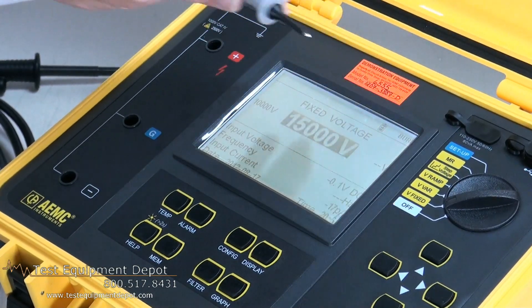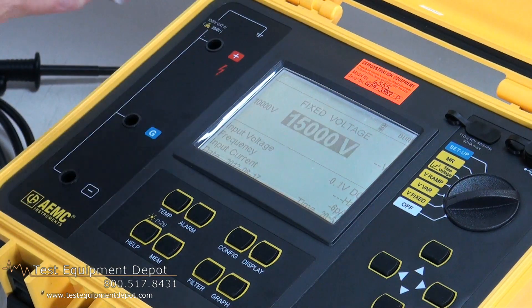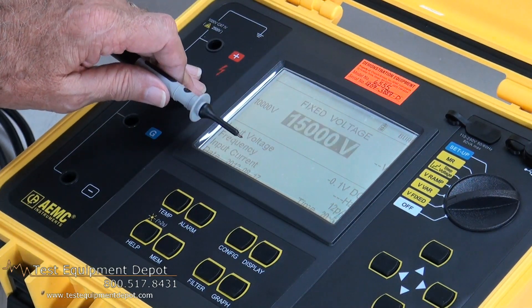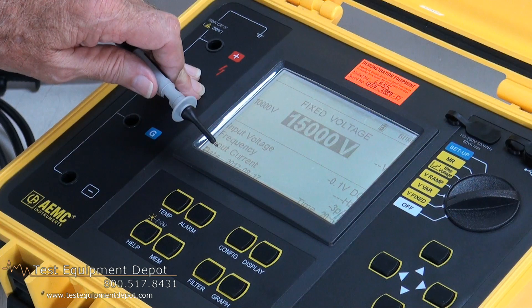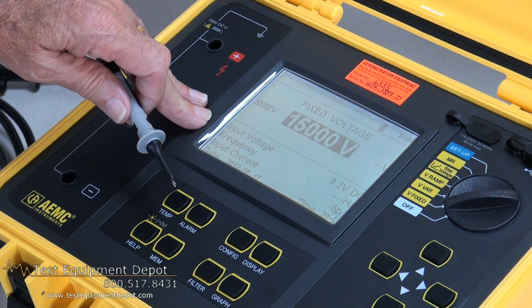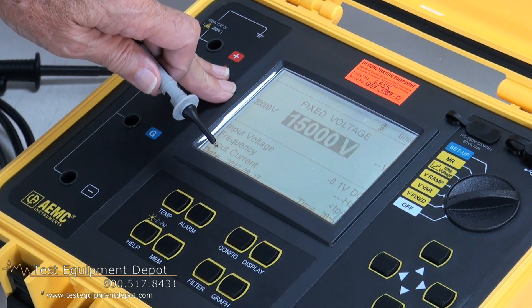In the V Fixed position, I now have the capability of emulating, to some extent, a high-pot test. That is, I can keep the impressed voltage on the test specimen for any length of time and I can also control the current. This allows us to go up to 5 milliamps at up to 15,000 volts, which gives us about 75 watts. This will emulate a high-pot test and will probably destroy the test specimen, but it will show us the failure point. Unlike a regular megohmmeter test, we don't know where the weak spot will be. In the burn mode, we can actually have it identify itself through discoloration, smoke, and heat emanating from the test failure zone or area.